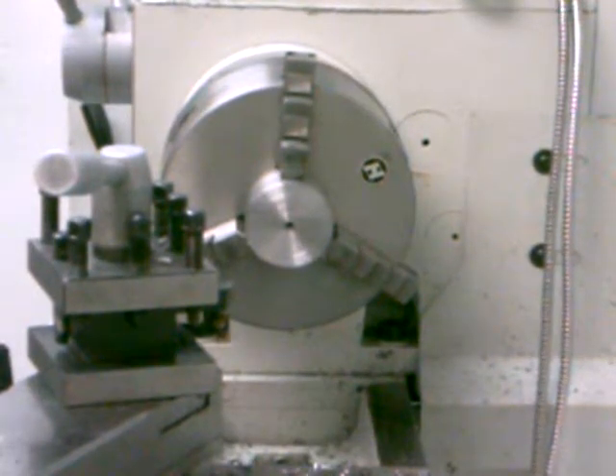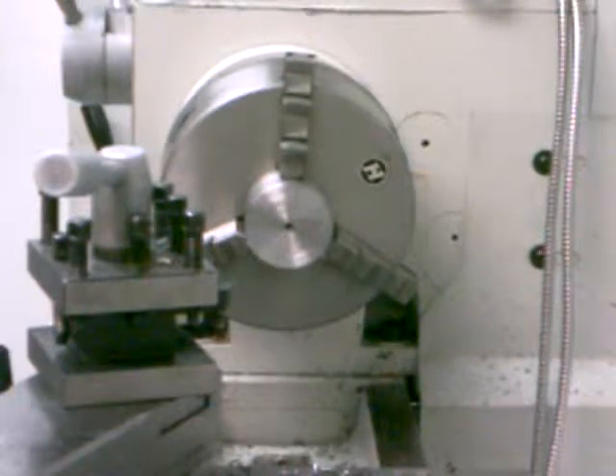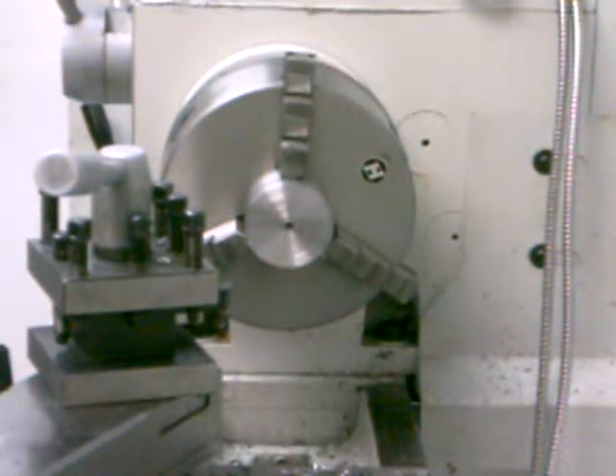There we go. We've got the start of our collar there — the outside diameter is turned to where I want it, and both edges of it are faced. Not super smooth facing on there, because most of that material in the middle is going to be gone by the time I get done with this thing. It's only going to have about an eighth inch to a quarter inch wall on it when done. That's going to end part one of this series on the outboard spindle spider on the YCL 1340 metal lathe. In part two, we'll start boring out the center of that. Thank you for joining me here today — we'll see you next time. Until then, happy machining.